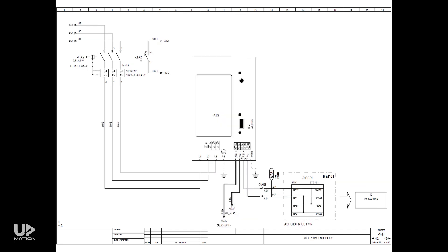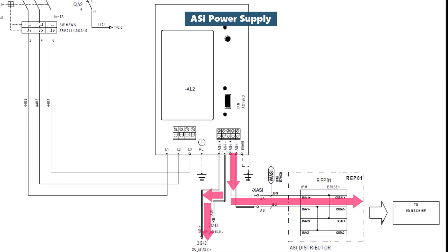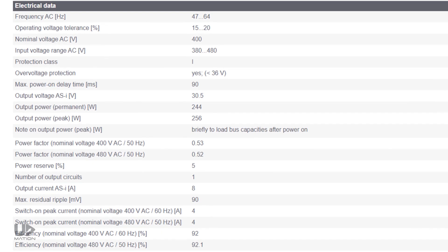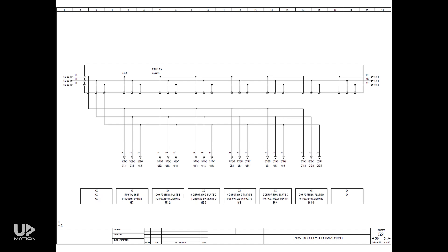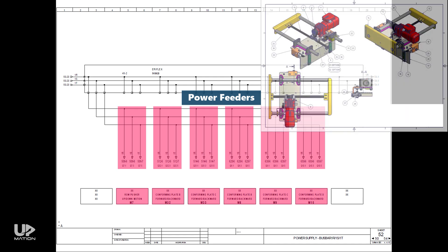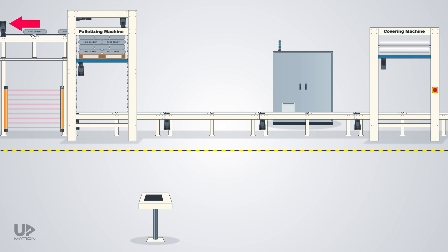As the designers have chosen the AS interface for some parts of the machine, the next page is about fitting the AS interface power supply with three-phase power. From the output, different AS interface IO modules and sensors have been supplied. As you see in the datasheet of this power supply, the output voltage is something around 30V. Again, we have some three-phase power distribution here — most of these three-phase feeders are going to supply our electric motors, each of which is in charge of moving a mechanism or part of a mechanism.